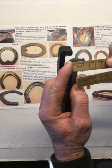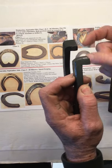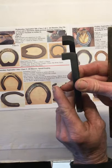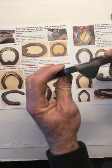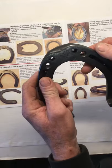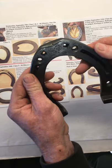The medial is maybe just a frazz shorter. They're just set down — they're not really forged in. There's no cold shut in front of them. It's a good thick strong clip so the toe is rounded off somewhat, but I think you still have to put some material in there for the toe.